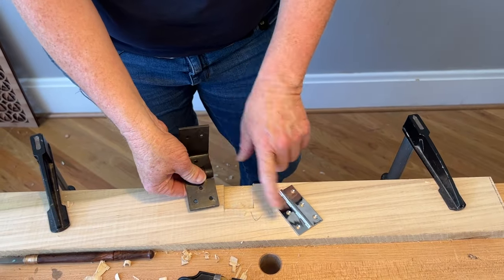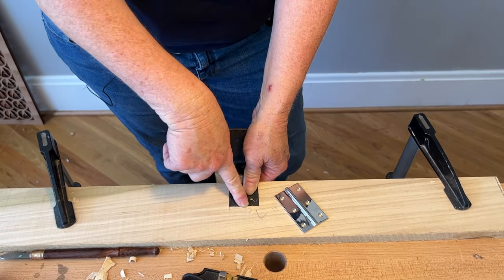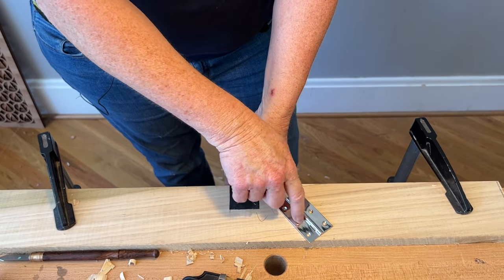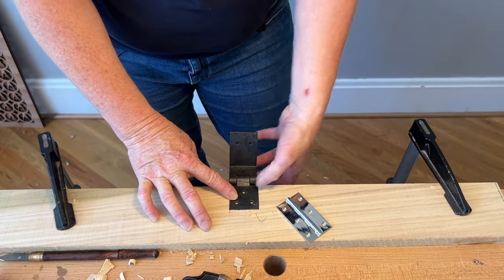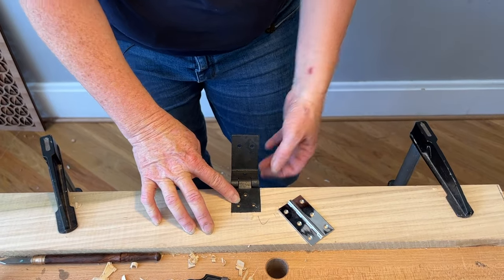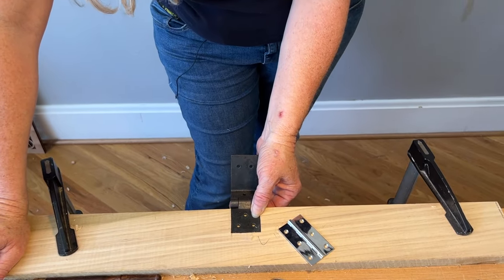It's pretty simple really. The only difference between this and the butt hinges is that having cut this mortise to fit this hinge leaf, I've now dedicated this one to its mortise. You don't have to do that with a standard butt hinge, but it's important with anything handmade that you designate it to its own mortise. That's it — pretty easy.